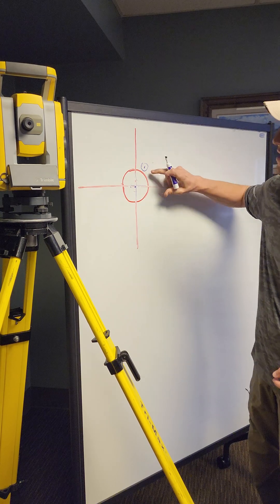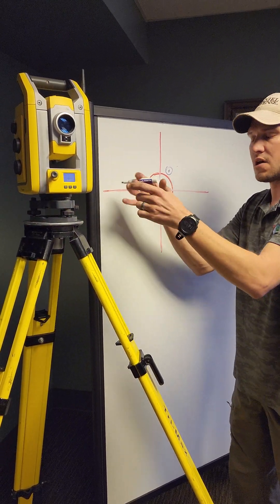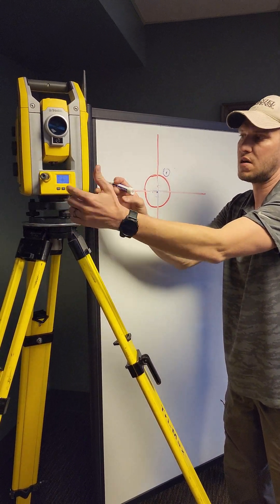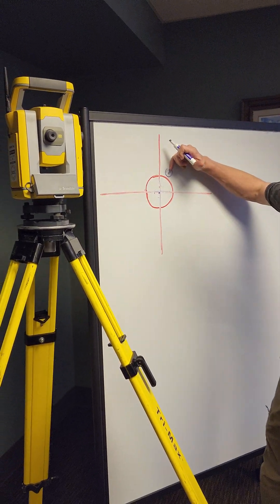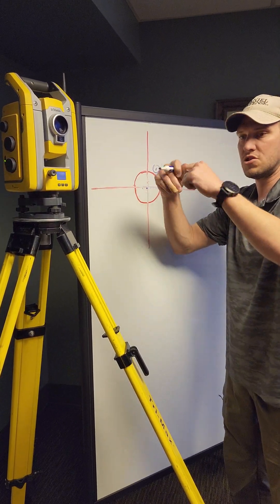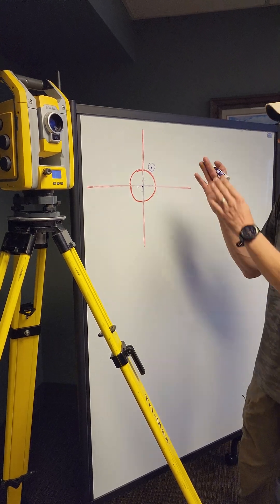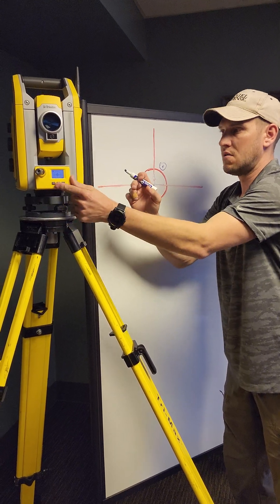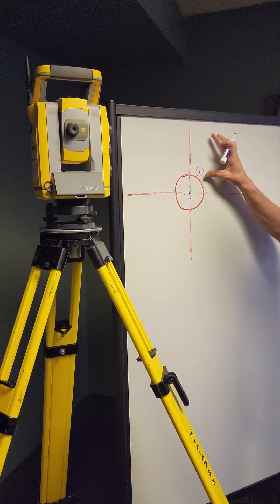Now the PK nail is at the halfway point. Flip it back around, re-center and get directly over your point, then flip back over — you've taken out half the error. Keep flipping back and forth while adjusting. The key thing to remember is don't chase your tail: take out half the error, then when you flip back and adjust, swing the other direction and it should stay. Just fine-tune that in.